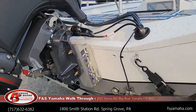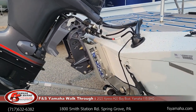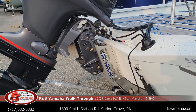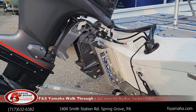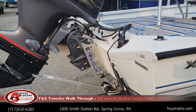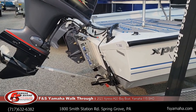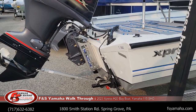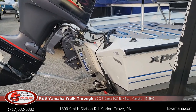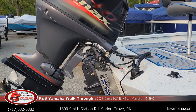Six-inch jack plate. I feel it's important that pretty well every Express that we order, I get with a jack plate, whether it be a manual jack plate like this or hydraulic. Feel free to reach out and I'd be glad to explain the differences between the two. The jack plates, with Express's performance hull, make them perform better — hole shot, turning, even top end, and also little things like clearances of cables back at the transom. That's why I get every Express with a jack plate.